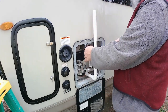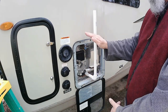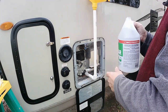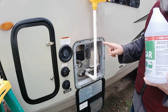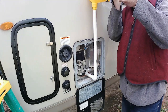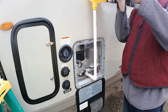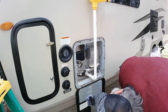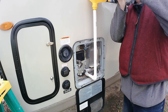Then you open up your valve up here on top, and that'll let air go into the tank. Now we're going to put 30% vinegar into this tank, because this is a steel tank. The Atwoods are aluminum, so I don't believe you need to do that with those. So we're going to go ahead and start filling this up with 30% vinegar — two gallons — and then we'll cut the rest with some fresh water.